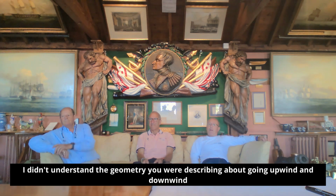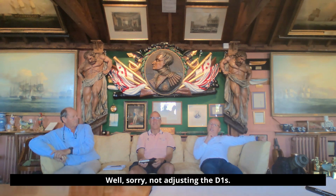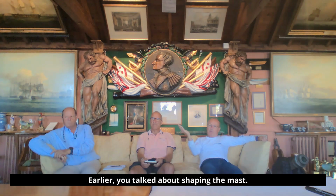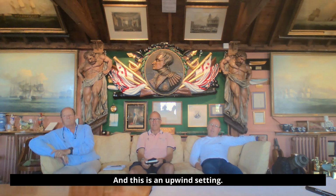John, I'm awfully sorry, I didn't understand the geometry you were describing about going upwind and downwind with your adjustments on the D1. You said the mast curve, not adjusting the D1s. Okay. I mean, you're letting the backstay go on downwind, so the mast can flop as far forward as possible. Earlier you talked about shaping the mast. Ah, yes. So this difference is laterally sideways, and this is an upwind setting.